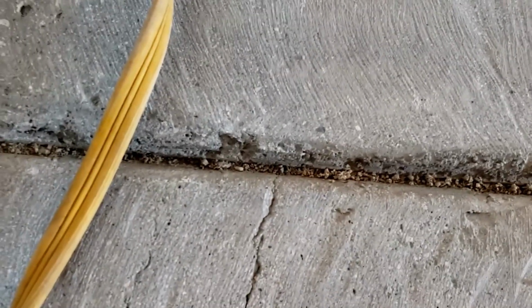Okay. Well, we got her done. All the sand's in the crack between the two slabs on the floor. And let me show you what that looks like. Yeah, you can see I got sand down in that deep crack. It was about 4.5 inches deep, and probably about the thickness of the slab. And I got it all filled up all the way down the line, roughly 1/2 inch from the top or so.